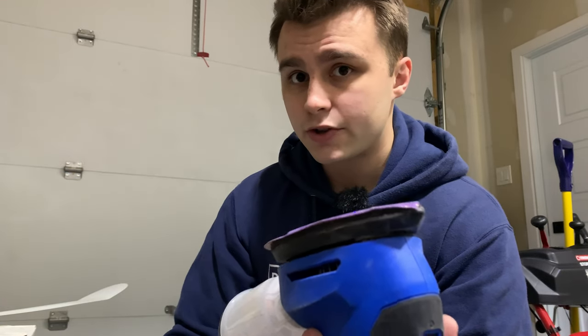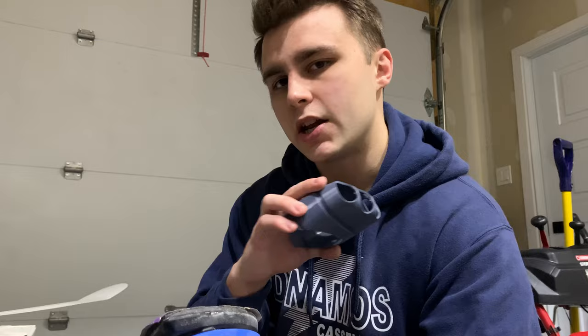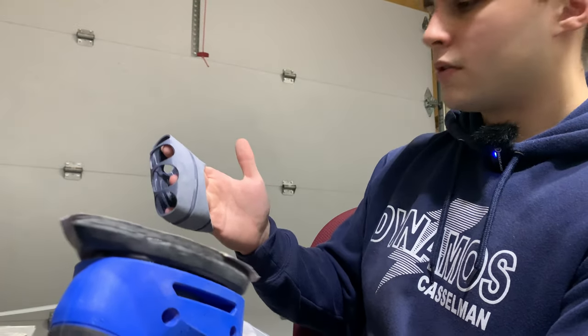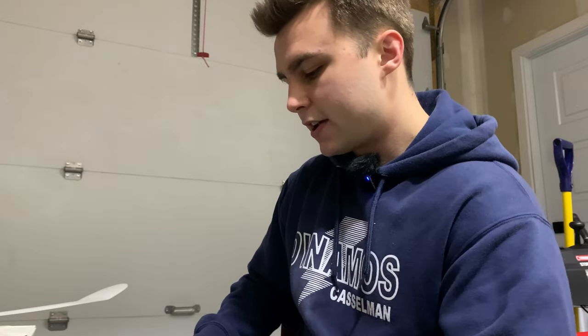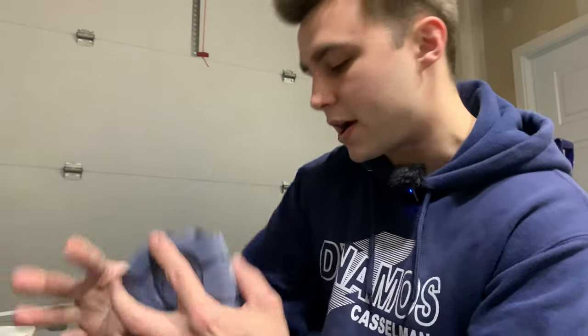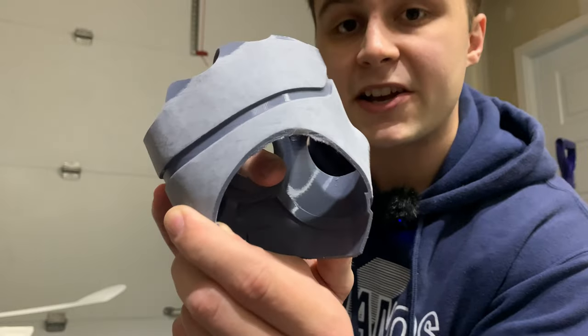Just remember that when using a palm sander, you want to make circular motions and not stay in one spot too long, or else you'll heat the plastic and warp it. Every once in a while, get rid of the buildup in your sandpaper — I just use my pant leg or a microfiber cloth. You'll want to do the same for your 3D prints, because a surface that looks fairly smooth can reveal layer lines once you give it a quick rub — that's dust buildup in the lines.